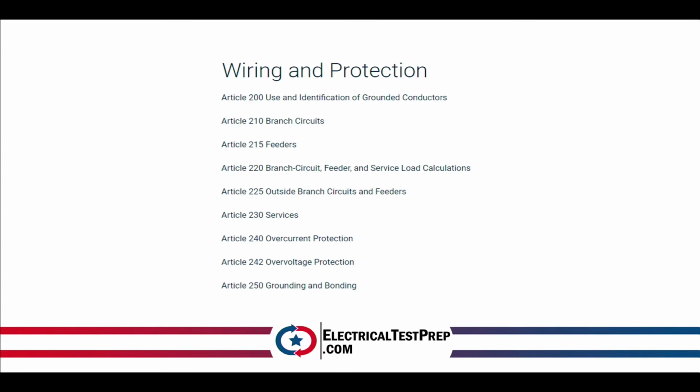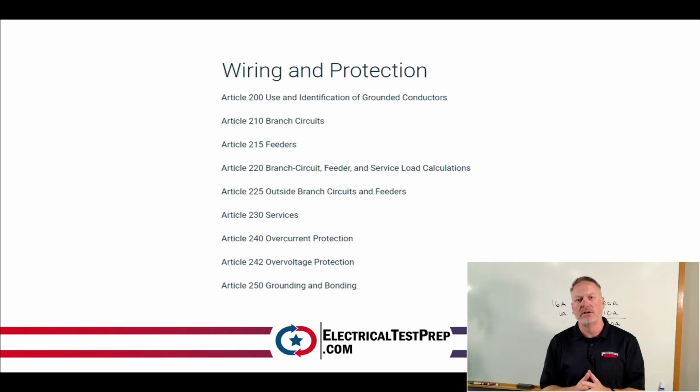Article 225 is going to be outside branch circuits and feeders. Article 230 is going to be services. 240 is overcurrent protection. 242 is a new article here for the 2020, overvoltage. What they did is they took all the information out of Article 285 and 280 as surge protective devices and surge arresters, combined those together and stuck that into an article, which is 242 for overvoltage protection.